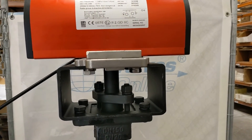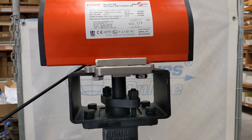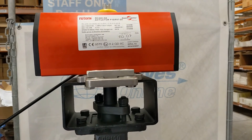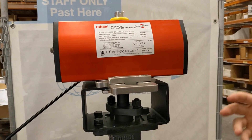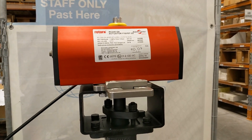What range of thicknesses are we talking about roughly — 8, 10, 12mm? Even larger for the bigger ones; it really depends on the torque of the actuator. They're sized off the mounting, so an F07 mounting has a maximum torque that can be put through it. The torque rating of this lockout is higher than that, so the safety factor is built in.